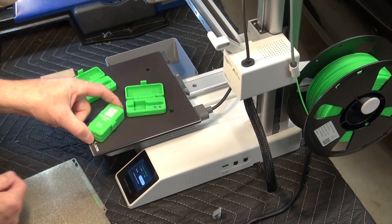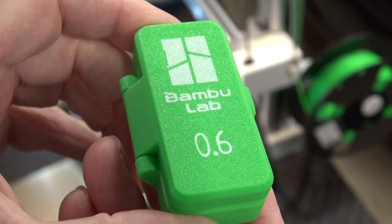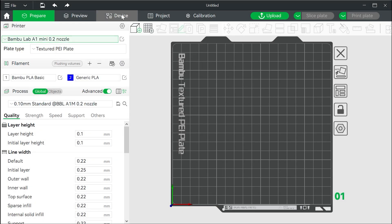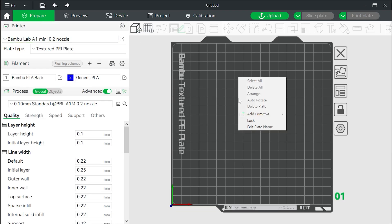Let's have a look at the print quality. You will get some imperfections, as you can see in the logo here, but this text is good enough for its basic purpose. Something that will help with small text is a finer nozzle — I recently purchased a 0.2mm nozzle. Don't forget to tell the printer what size nozzle you are using.